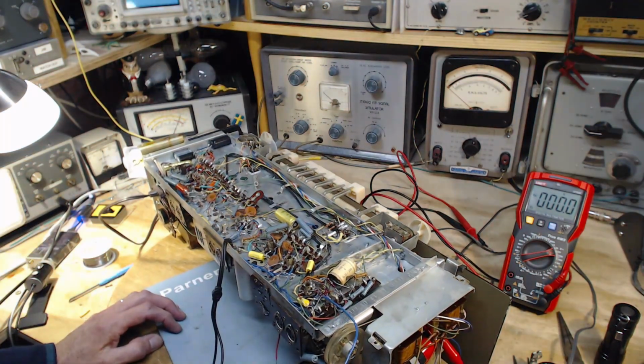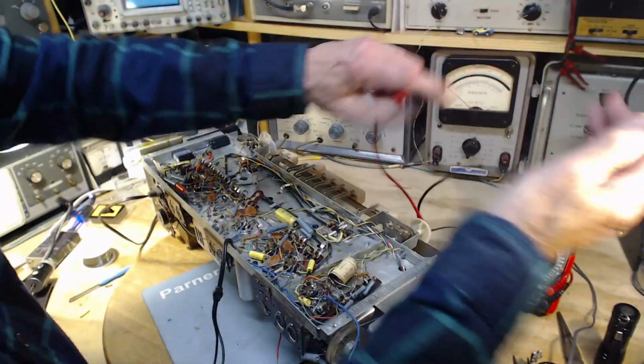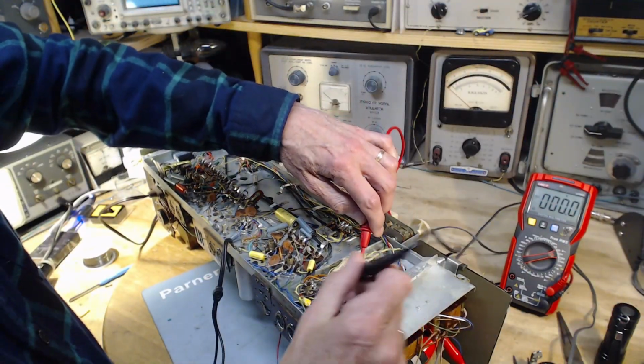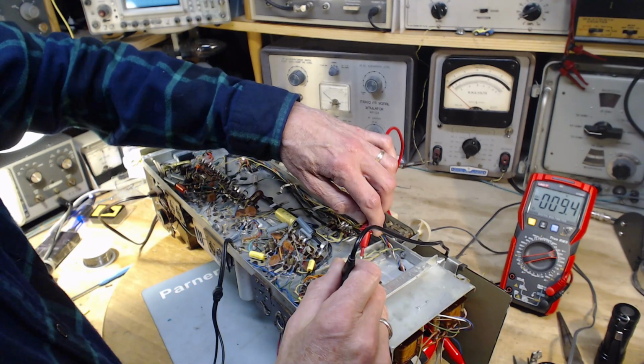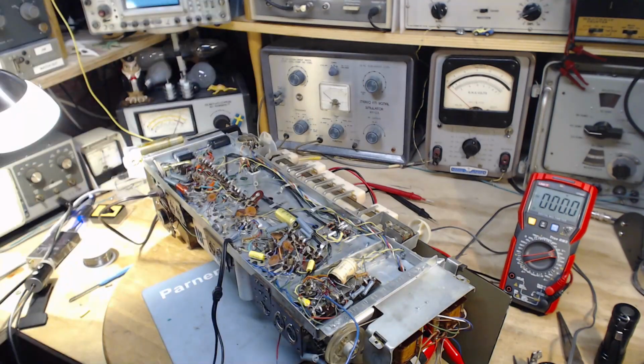Is there any other circumstances here? Phono, in the phono mode? Could possibly. Just can't imagine something would happen now. 9 big volts. Put a low voltage capacitor there, 330 nanofarad capacitor, and we're done. Great.